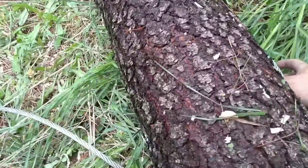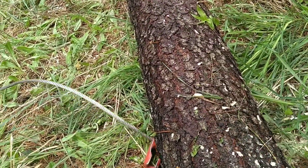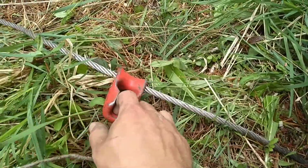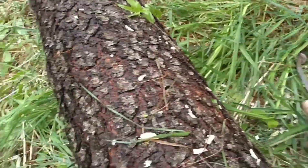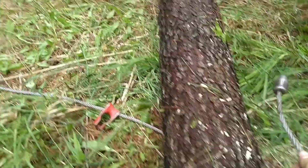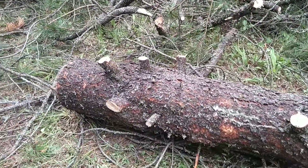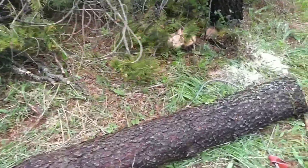This is how a choker works. On one end, you have this bulbous piece of metal, and then you have this long cable with a loop on the other end for a shackle. Then you have this piece, which slides independent of the cable right here. Then you take this bulbous piece, slide it under the bottom of your log — there's a reason why I say the bottom. Note the direction of where all of the limbs are pointing. You don't want those digging into the ground as you're trying to pull it. You want those to just be skating along the ground.